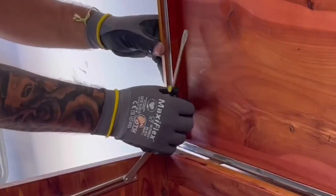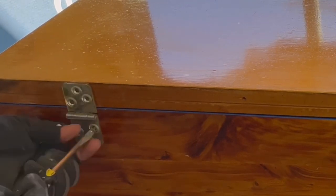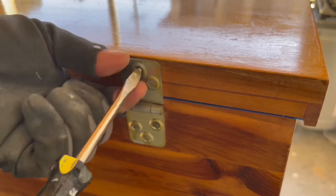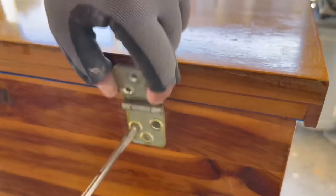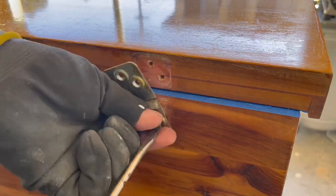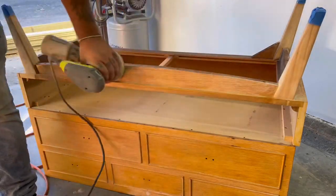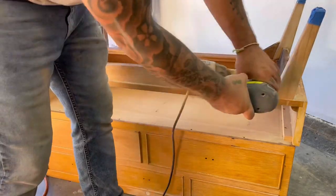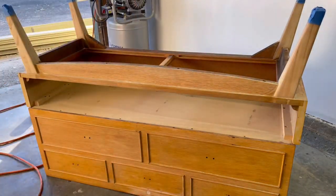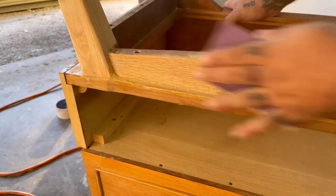I'm removing the top because it overlaps with the face and sides of the chest — that way I can paint all the way to the top and not leave exposed wood when opening. I'm sanding the base and the legs down to bare wood because I plan on staining it in order to give it some contrast against the paint. I was able to use my orbital sander on the flat surfaces, but for the corners I had to hand sand them because I just couldn't get to them.